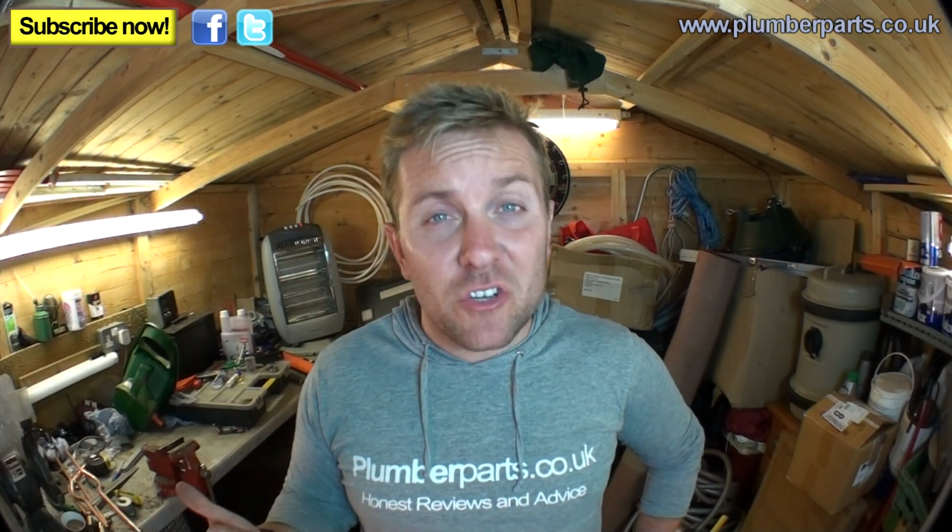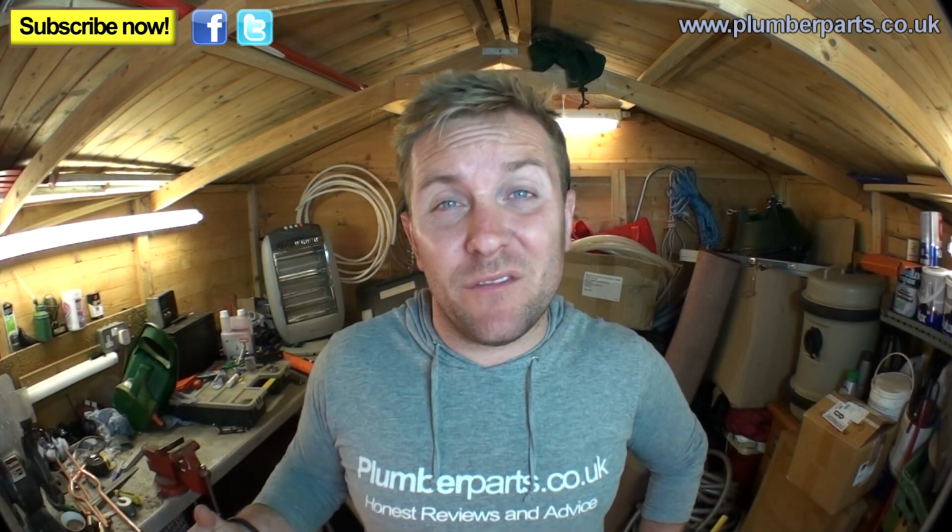So, I hope you found today's video informative and helpful. Remember, as you go on and the more bends you do and all different types of copper pipe work, you will start to use less tools for it. You probably won't use your ruler after a while. You probably won't even use your measuring tape. You'll look at it and go, well, that's a 28mm pipe. I'm going to need a 35mm crossover, so I'm going to bend that out, look at it like that, it's going to be absolutely great. Once you've done it loads of times, you wouldn't have to go through all the stuff that I've been going through, but that's the full-on theory of how you do it.